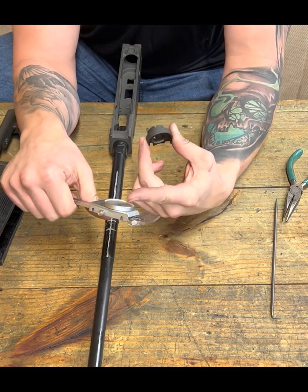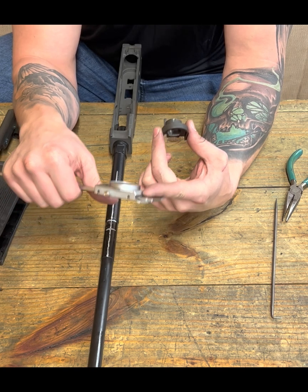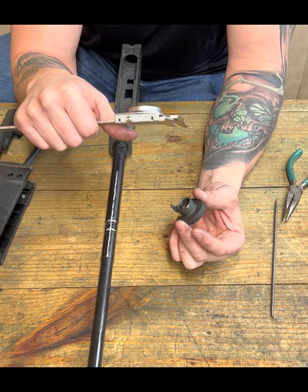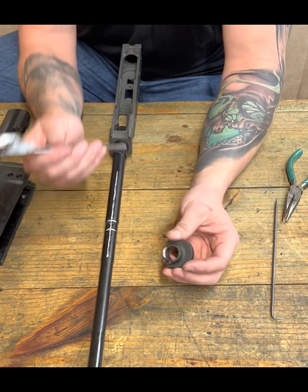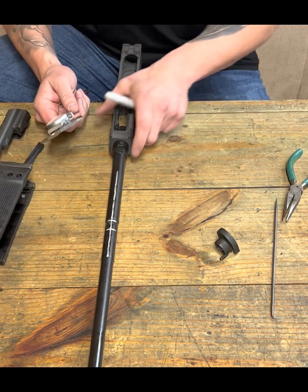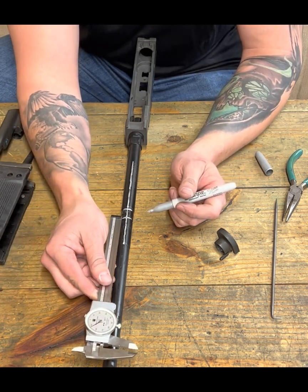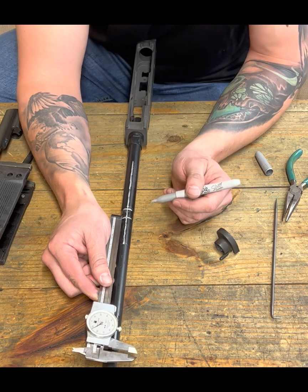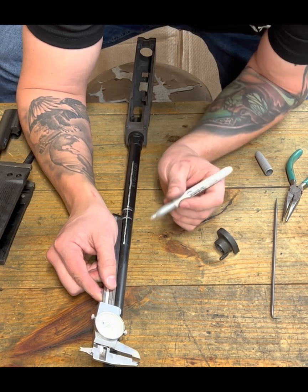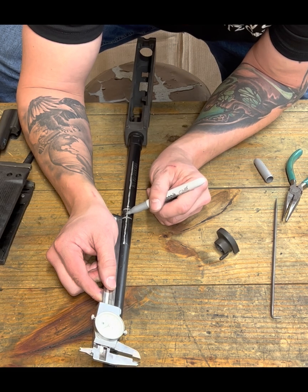And so that's telling me, if I'm reading my calipers here, looks like 188, yeah, 188 thousandths. And so, okay, if I want to go that way, I can use the same thing off my calipers. I can butt this up against the leading edge where I drew the line, okay? I want to make sure that I'm staring down the top of this. And it's still at my 188. I've got that about so. And I can make a reference line.